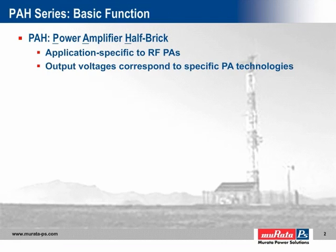Power amplifiers use various material technologies — that is, the materials from which the amplifier transistors are constructed. These include gallium arsenide, gallium nitride, gallium arsenide-gallium nitride hybrid, gallium nitride-silicon carbide hybrid, as well as silicon in LDMOS and VDMOS varieties. Various considerations make each of these materials appropriate for specific end uses.